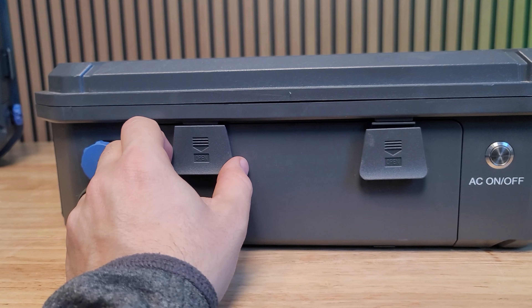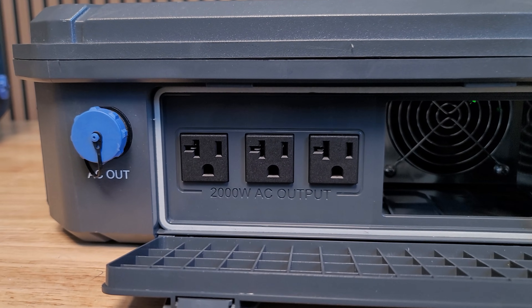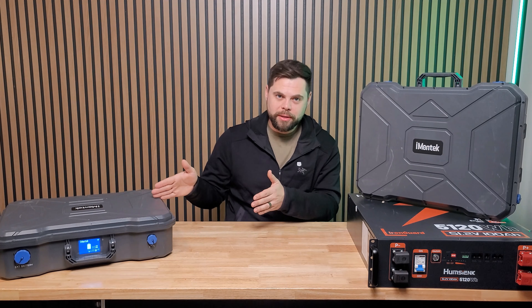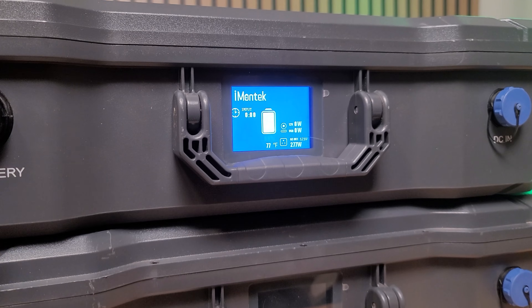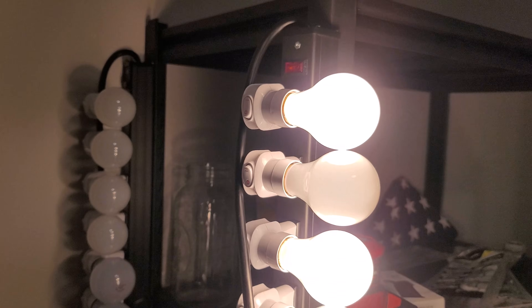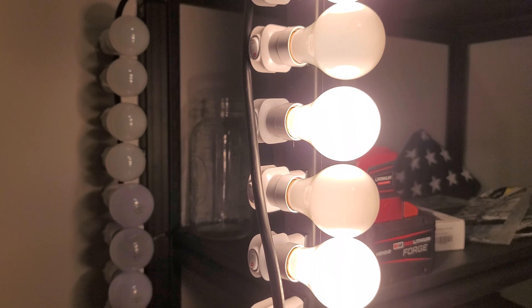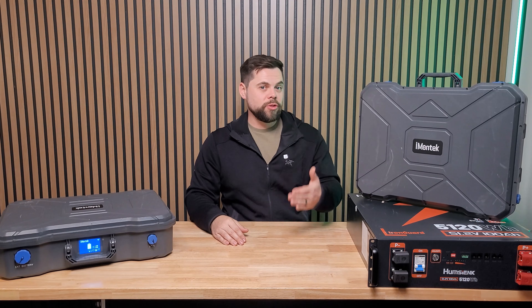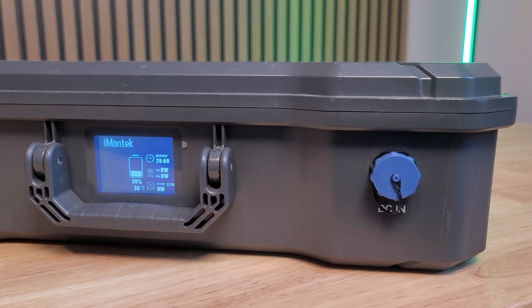On the AC output side of the unit, you have three outlets rated to 20 amps per outlet, but overall you're not going to get more than 2,400 to 2,500 watts, even though it's rated to 2,000 watts. I was amazed when testing the inverter — I got 91% efficiency putting a 0.2C load on it. That means I had 1,165 watt-hours of usable AC power, even though it's rated to 1,280 watt-hours. The idle power consumption rate is quite low at only 18 watts.